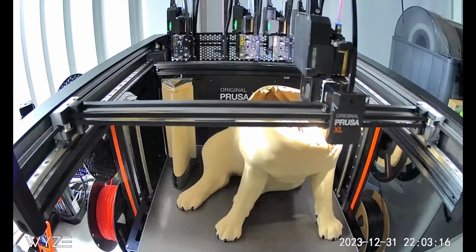The other thing that I do when I'm running this again is I went back to the grid infill. The main reason that I did that was because I stupidly thought that it would also affect the infill on the tower. That's what I felt like was a big issue in addition to the red, that the tower just needed a little more support inside. But I didn't realize until way later, when I'm really looking back at this, that the infill grid only applies to the print. It does not change the tower. I guess that makes sense because we don't want to be using a lot of excess material on the tower, but in a scenario like this where your tower falls over and has issues, not very great.